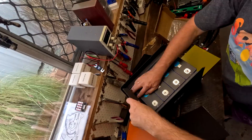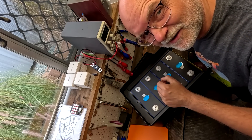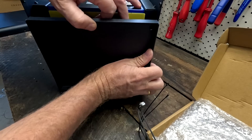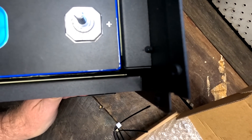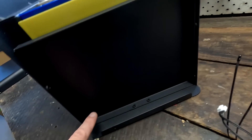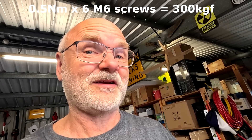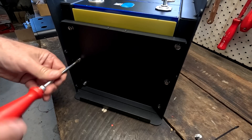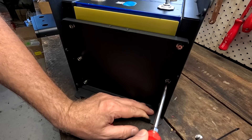I've got some foam in stock. It looks like we need only two sheets — one at the back, one at the front — and this should give us enough compression. There's about three or four millimeters of gap now, and we've got six M6 screws to tighten at only 0.5 Newton meters to create 300 kilograms of force — we shouldn't even call it compression, it's more a fixture. The plate will stop compressing the cells at some stage, and the foam will lose compression force over time anyway, so we can just screw them in all the way.